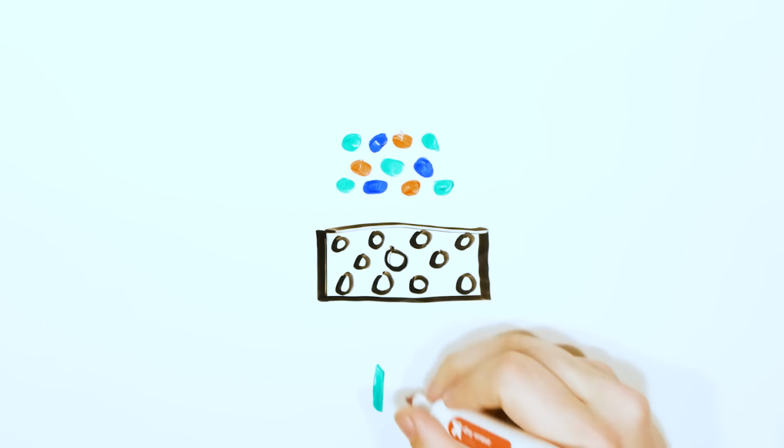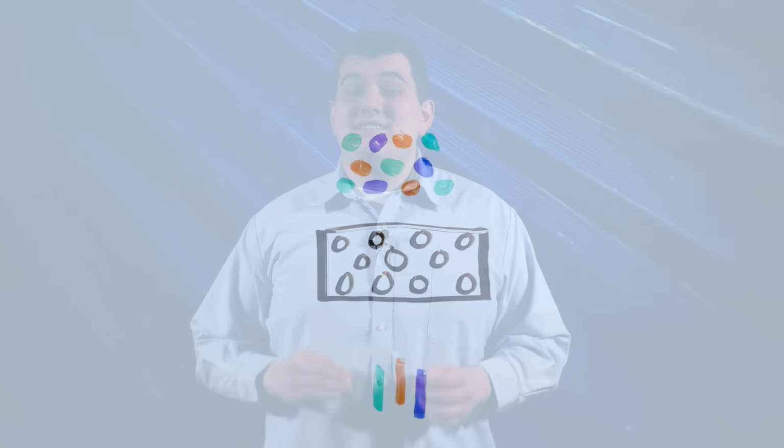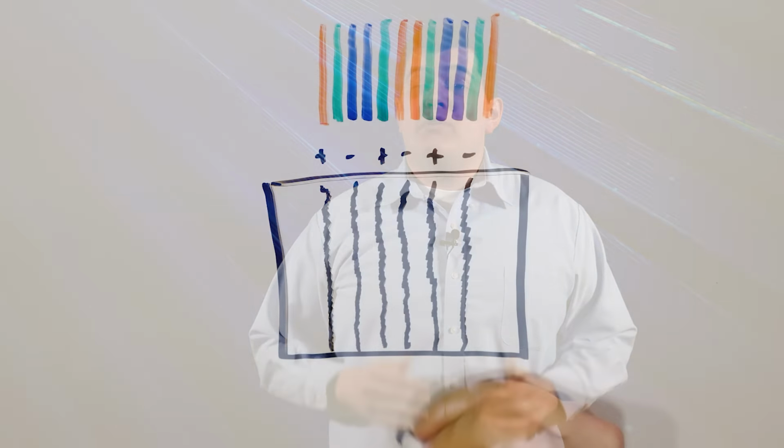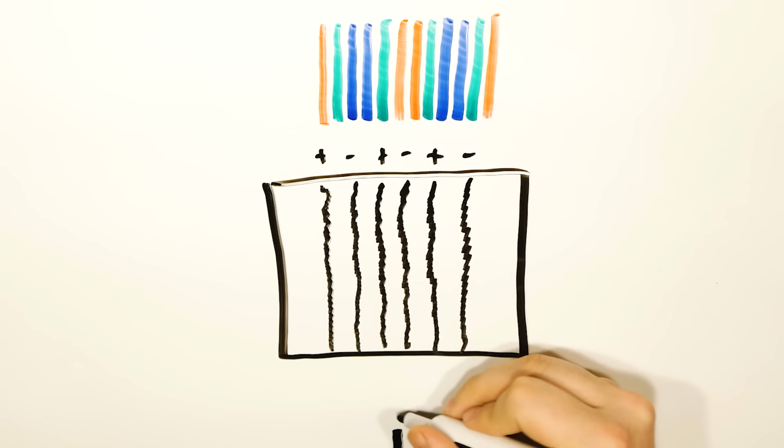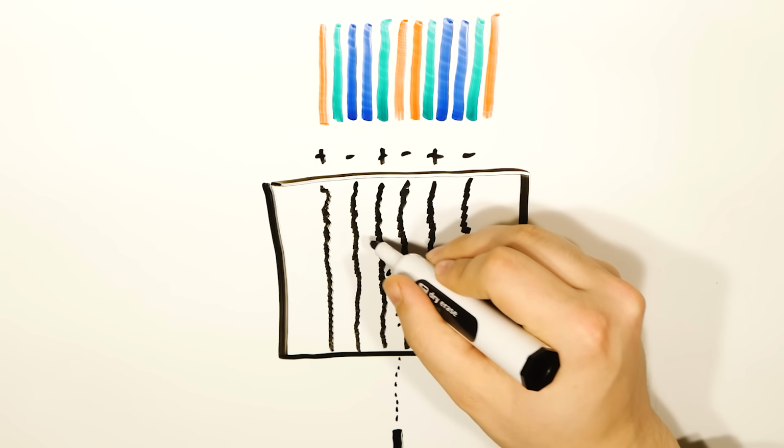Rather than use three electron guns and a matrix of holes to create the separation like the standard shadow mask tube did, the Chromatron used a single electron gun combined with a vertical grille of electrically charged wires at the front of the tube. In essence, the Chromatron relied heavily on electronics to focus the electron beam onto the correct color. The beam was normally focused onto the vertical green phosphor stripes present at the front of the screen, but the deflecting wires, placed about a half inch behind the phosphors, could push the beam to either side and light up the adjacent phosphor stripes.